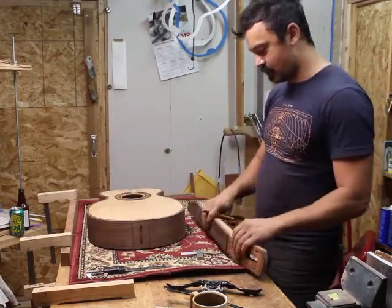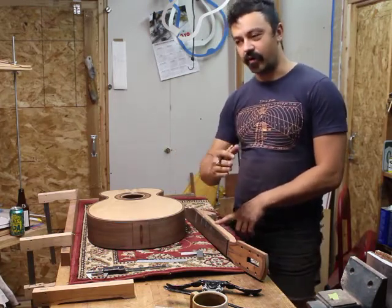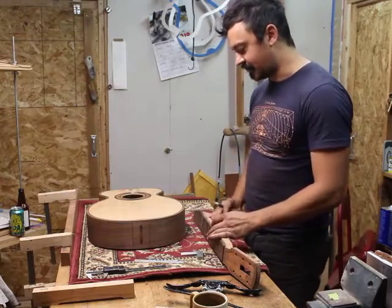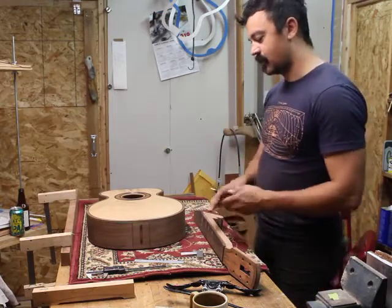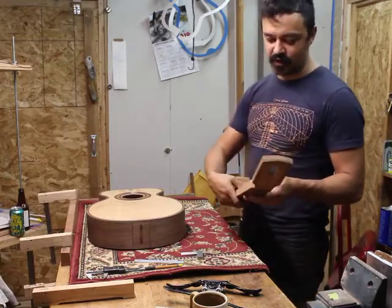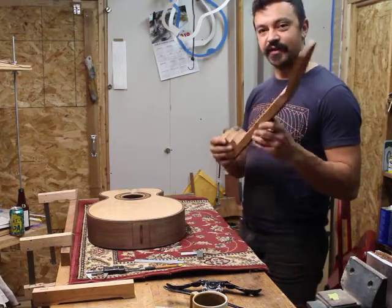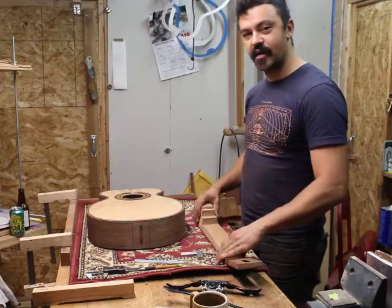To account for the taper, I'm going to do the same thing at the other frets. The fifth fret cut will be about 19mm — since 6.4mm is basically the same as 6.5mm — and I'll extend it a little more for the 10th fret. I'm going to cut those in and start roughing in the neck down towards those lines without taking them away. I'm also going to cut the heel away with a coping saw so I don't have to spokeshave that waste wood. Basically I'm just going to start removing everything that isn't a neck on this block of wood, and at some point in that process we'll pick back up and talk more about neck carving.